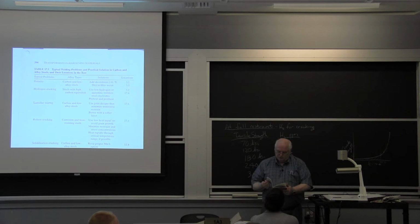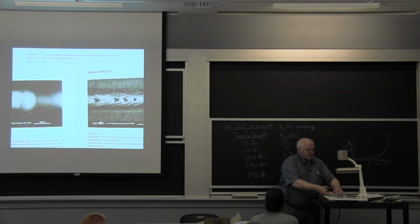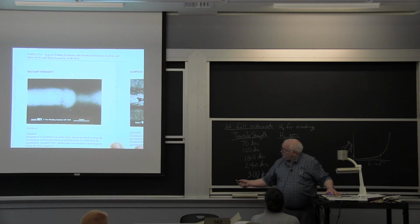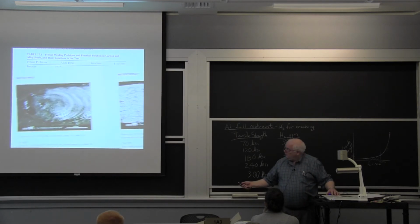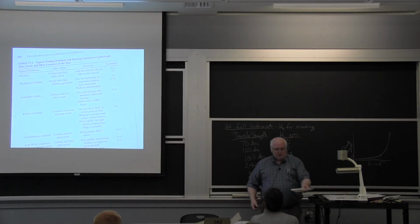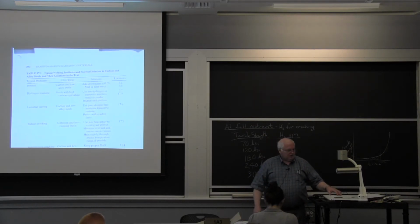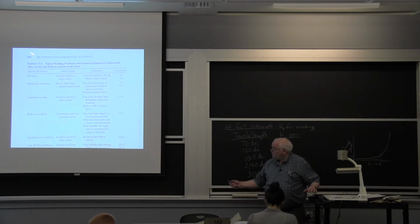Someone here, I'm sure they have porosity. Here's some surface porosity. Right here, here's an X-ray with some restart porosity. They restarted a weld and you get porosity. Here's a crater pipe, and then you got micro porosity. So there's all kinds of, and there's other cracks in here, you can pass that around, but this is something to train inspectors sort of the types of defects you can expect in welds.